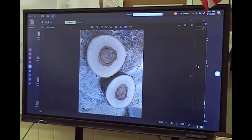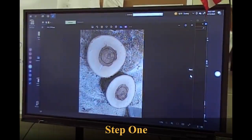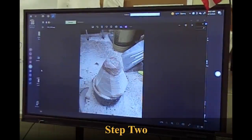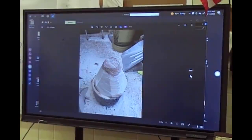I take a coffee can lid — a four inch lid — and a magic marker, find the approximate center of the log, set it down and mark it. That's step one. Step two: stand that block up, set your chainsaw right by the magic marker ring, cut down to the outside of the log and make a comb. You're cutting off four wedges first, then take the corners off so it's eight-sided. You get a bunch of thick wedges — makes nice little projects. That's step two.